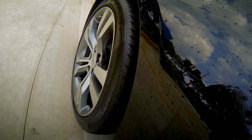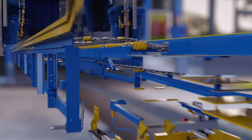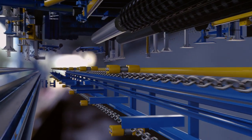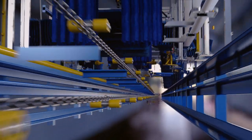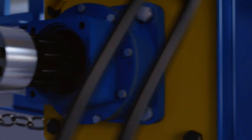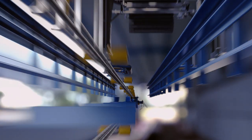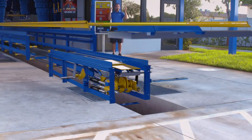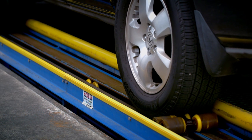The conveyor has to tow two-ton cars to exactly the right position for a perfect clean. The secret lies hidden underground: a hardened steel 80-meter long logging chain, welded to toughened four-wheel rollers, pulls five cars through the machine at a time. Electrics don't mix with the wet and hostile environment of the car wash, so a hydraulic motor powered by high-pressure oil drags even the biggest car to exactly the right place at the right time. The rollers pull the car at precisely 17 centimeters a second.